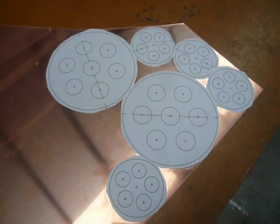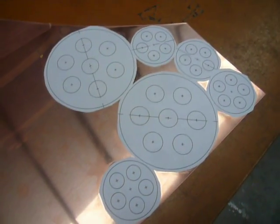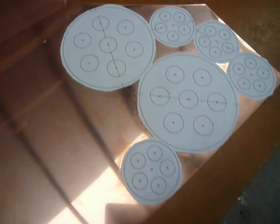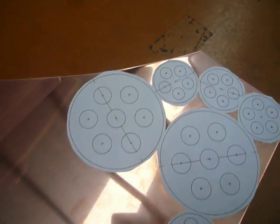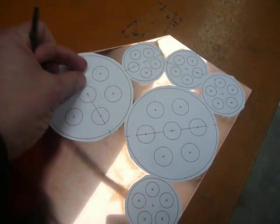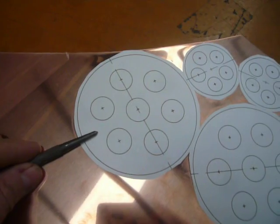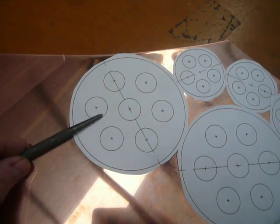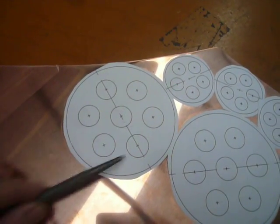So you can see I've got the baffles all center punched now. What I didn't point out before was when I marked these out, laid them out, the idea is to get your water flow maximized through your column here. All these little tubes will be coming up through the center between the baffles. So the water will be coming in ideally through the side of the column there, between these tubes, and that'll get the maximum water flow into this thing.